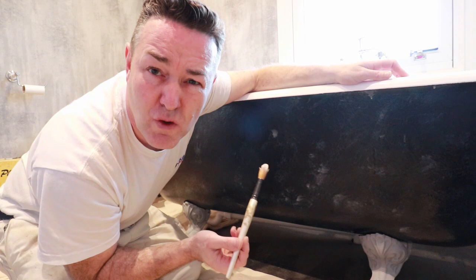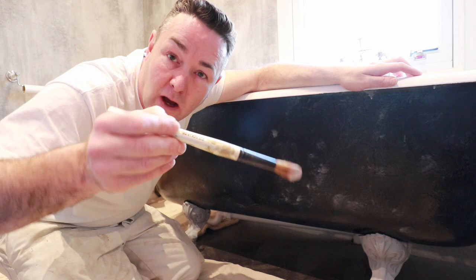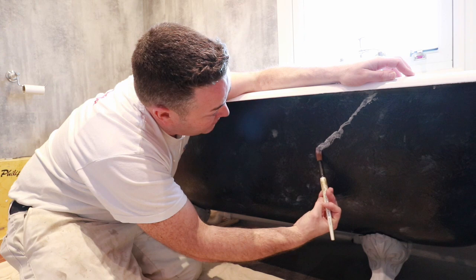It's quite hard to explain without you being here. You ought to be here. I'm going to apply the brush to the surface, and as I'm applying it, I'm not just painting it down, I'm rolling it and I'm putting it on, off, on, off. And you'll see what I mean. Tip, fat, see I'm rolling it down. Now with the tip for a bit of a finer vein.